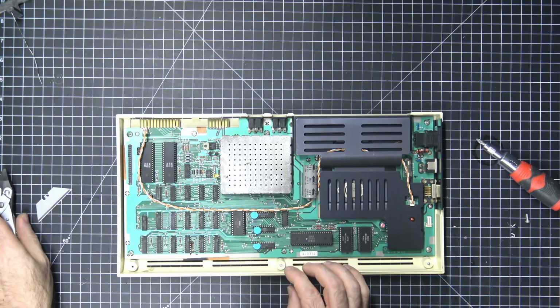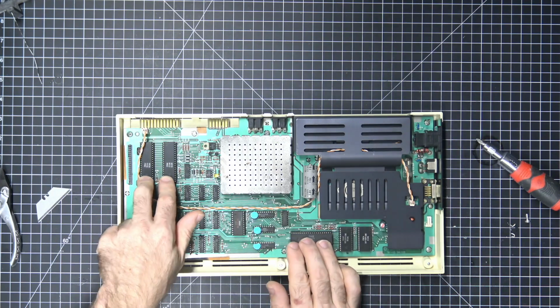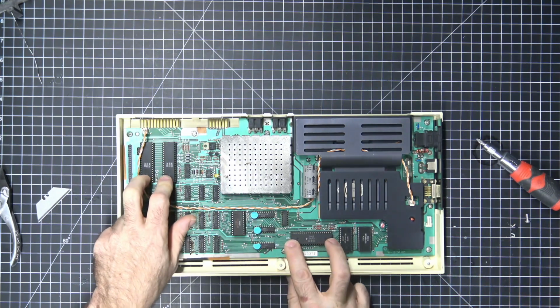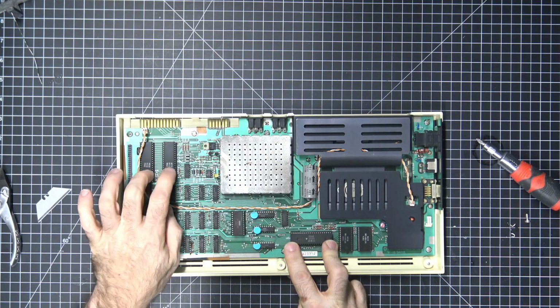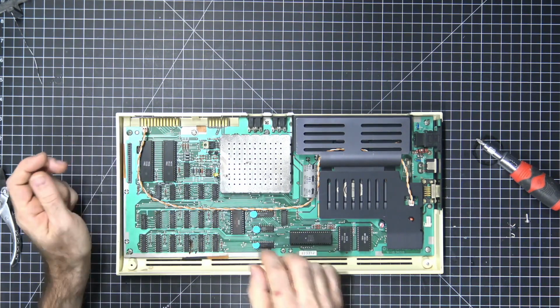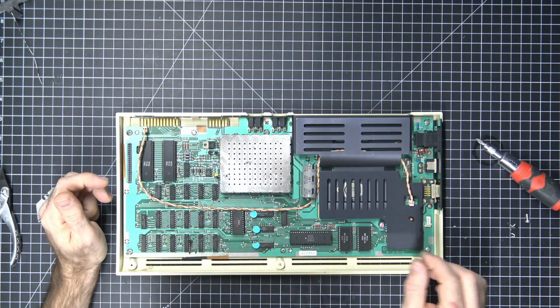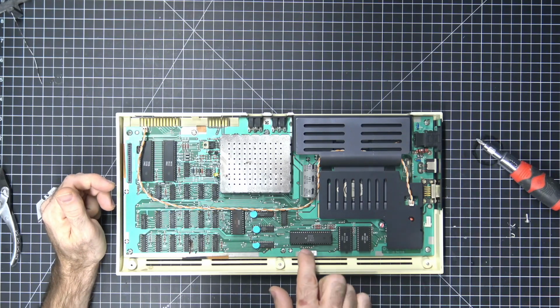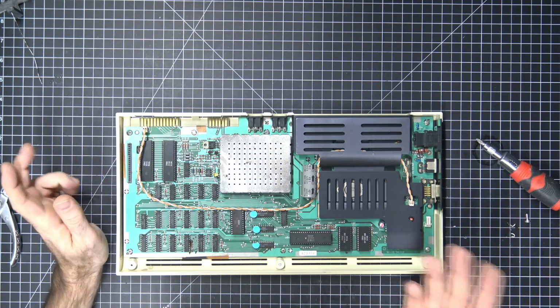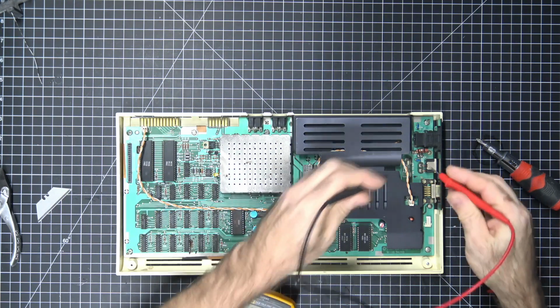So, you know, we got the usual stuff in here. We've got the 6522 and 6502, right? The 6502 is the CPU, and the 6522 are the CIA chips. For the VIC-20, they use the 6522s, which are more common, and the 6502, which is also more common, easily replaceable. Because I don't even know, I think we might have replacement fuses for these.